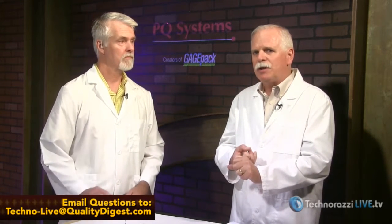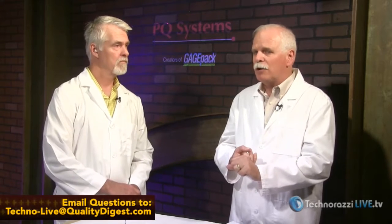Okay. So data is always needed when it's out of tolerance. You need to know how far out and which direction. That can make a big difference too. Or if we did an adjustment, a lot of times we will accept with adjustment. It's allowed plus or minus 5, and it's going to be out there for a year, and it's running 4.5, 4 and 3. It's almost 5 thousandths. A lot of times the customer will have us put it back to a nominal. We do have to record the before and the after data. That needs to be recorded.